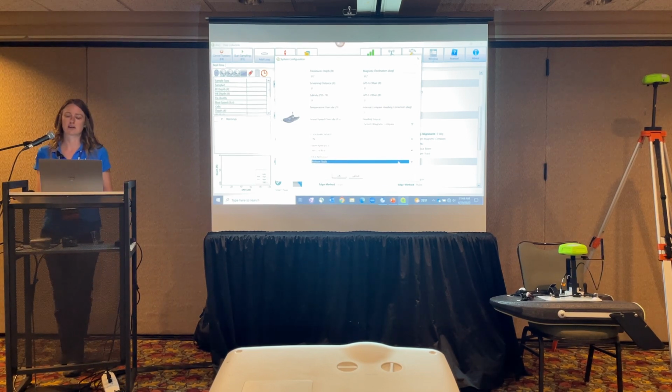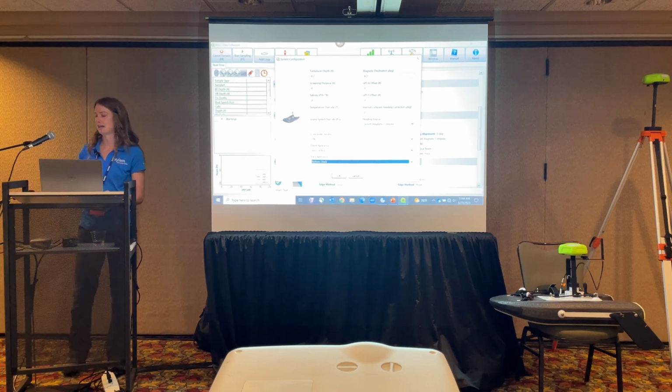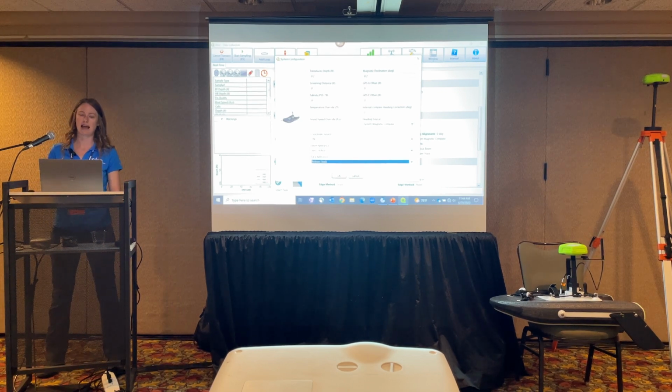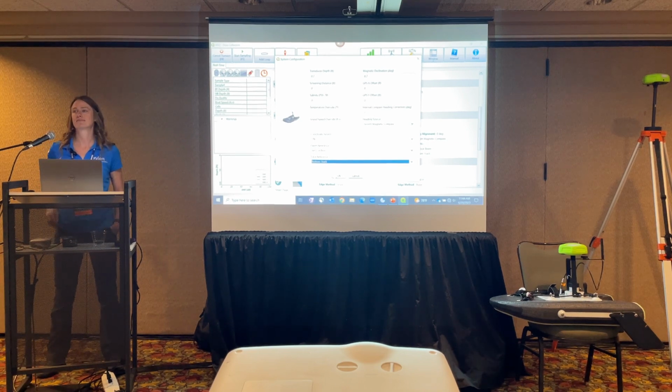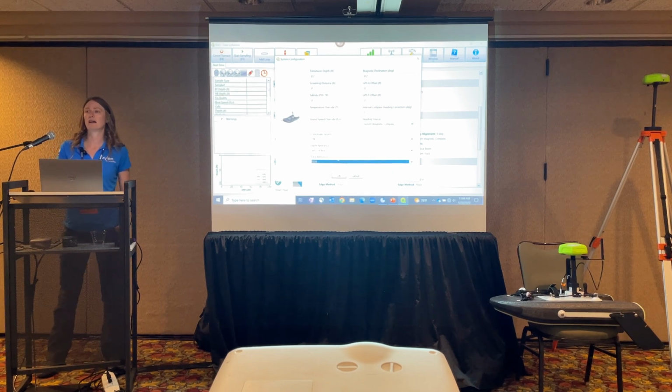So these three are going to control how I'm viewing data coming in. That means my discharge is being calculated based off of bottom track, vertical beam, and ENU, in real time. I can switch all of these around after I collect the data if I need to. A good time-saving thing at a site where you know there's always a moving bed would be to skip the loop method, skip everything else, and just go straight to GPS. I would definitely set my track reference to GPS here.